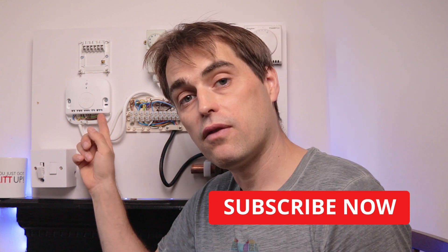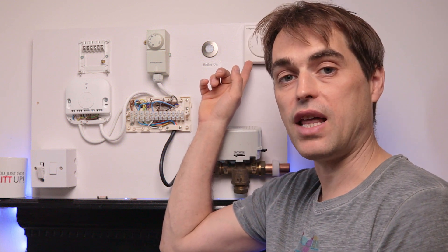With the heat link fully wired up, our next move is removal of the existing thermostat and installation of the actual Nest thermostat. We have two options: use an additional base for our Nest charged through a USB connection, or reuse the thermostat wires going to the wiring center and connect them to the 12-volt supply from the Nest heat link. If we do that, we install the Nest thermostat in place of the existing thermostat. First, we remove the existing thermostat.